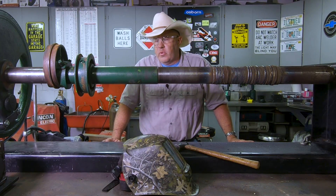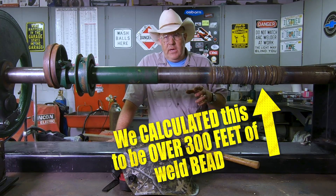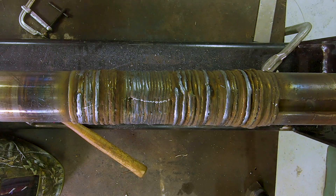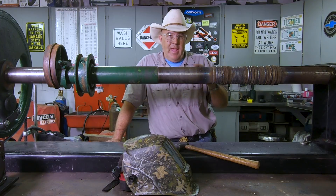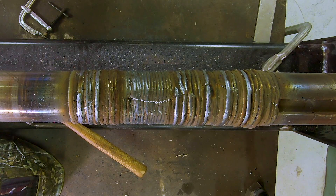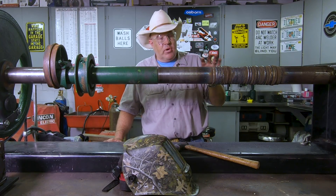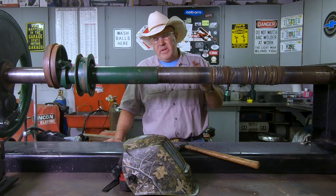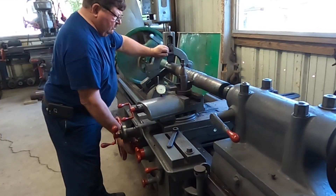We are about done with this project — at least my part of it. There are a couple of lessons learned. Doing the original first pass coming down was no problem at all — it was easy to see the weld bead on the next pass to do the one-third overlap. However, on the second pass while I was welding, it was really difficult to see where I had welded in the first pass versus where I had just welded in the previous rotation. That's why there are a couple of skip points here. The good part is we were almost to the perfect diameter with the first pass — the second pass was just a little bit of icing on the cake, filling a couple of little hollows. So when he cleans this all up, we feel like we're going to be 100% on this.